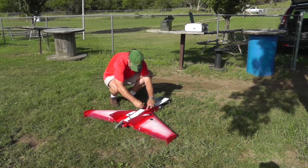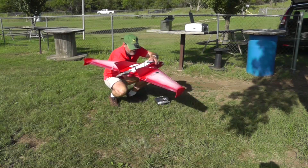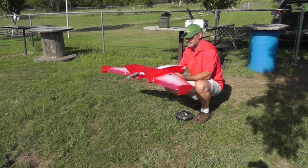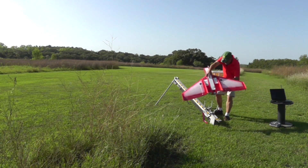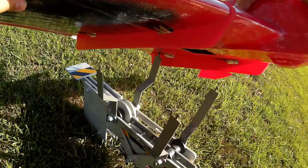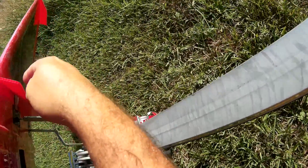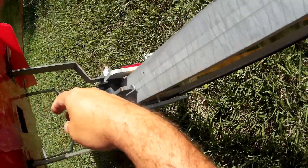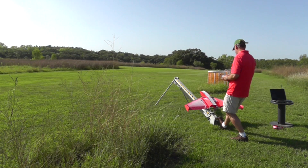The CG on this plane should be about 8 inches from where the leading edge of the wing attaches to the fuselage. It's always a good idea to check that the autopilot is moving the control surfaces in the correct directions. I'm using a bungee launcher made by Eagle — it's a very convenient design suitable for a wide variety of wing-type airplanes. You make hook holes at the bottom of the wing to adapt it to many different wings. It holds the wing firmly so you can open the throttle while it's on the launcher; in this case I'm launching at closed throttle and then opening it up.